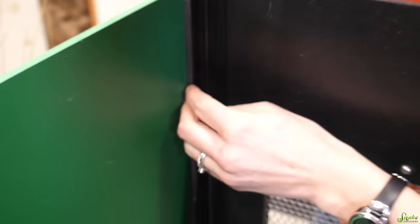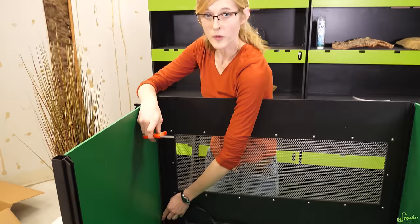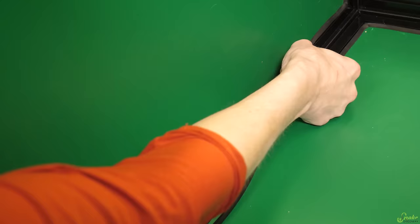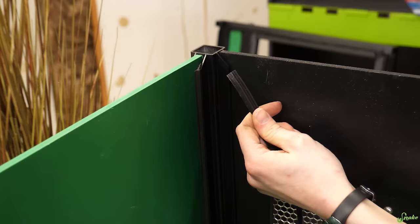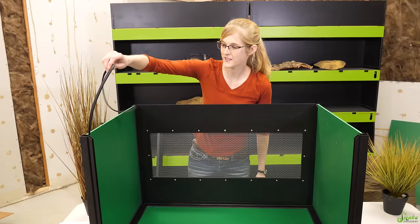We're going to have a little bit of this gasket hanging out — we'll get to that later. When you get to a corner, you want the gasket to turn, so in order for it to turn at a sharper angle, just cut a little notch in the side so it can overlap on itself. The end of the gasket is flat, but you want it to be angled to line up with the angle of the aluminum upright, so just take scissors and cut it at an angle. Now we've finished the first side and we're just going to speed through the rest.